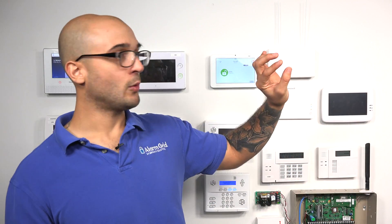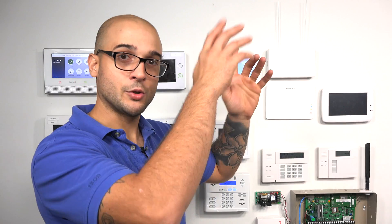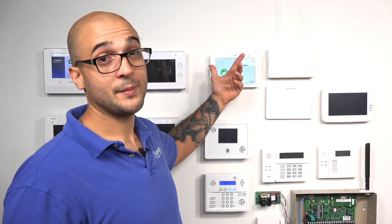We also sell a device called the Resolution 524, a universal wireless-to-wireless translator. It allows multiple different manufacturers to work with multiple other manufacturers. There are two dials on the translator — one lets you select the model of sensors it's going to be translating, and the other lets you set the type of system it's sending the information to. So if you have Honeywell 345 sensors in the home and you install a Qolsys, you'd set one dial to Honeywell and one to Qolsys, and it would translate them through and allow them to work with the system.